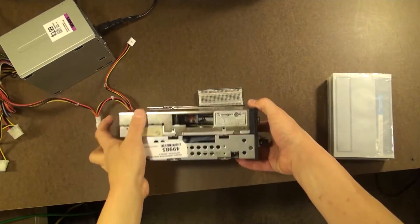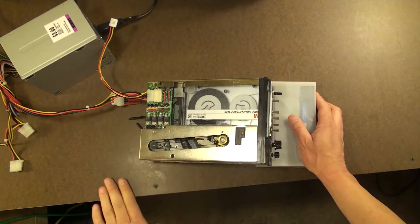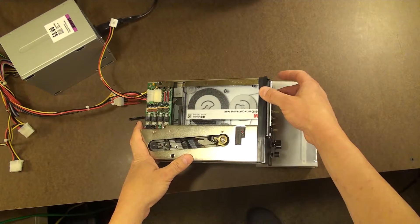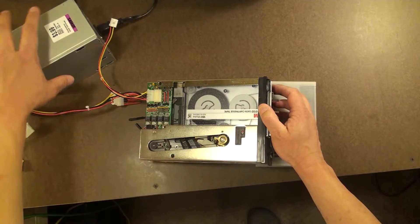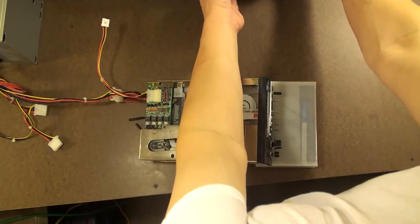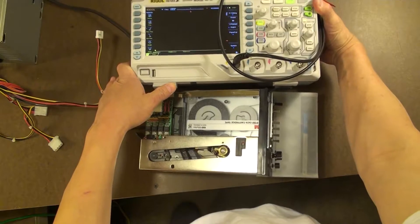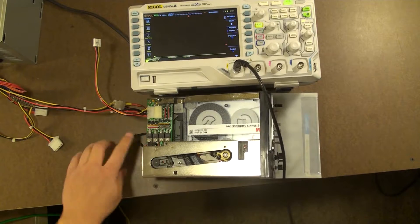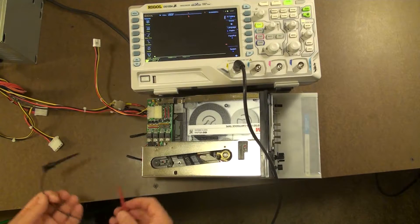I'm going to take the tape out and put it back in again to initialize it and show you how it goes to logical track zero. Hit go-stop — it goes all the way down, then up, and this is where it thinks track zero is. Doesn't mean that's where your track zero is on any of your tapes — you may have to make fine adjustments up and down. Now let's test the data pulse output with the oscilloscope. Let's bring the oscilloscope into view — I already have it powered up. Here are our probes — I'll connect the ground first, then the data pulse.